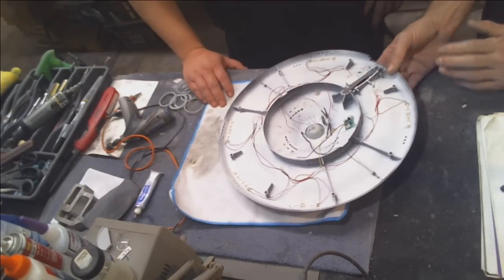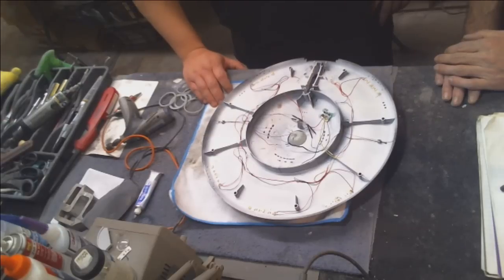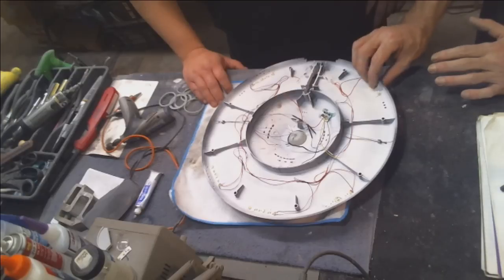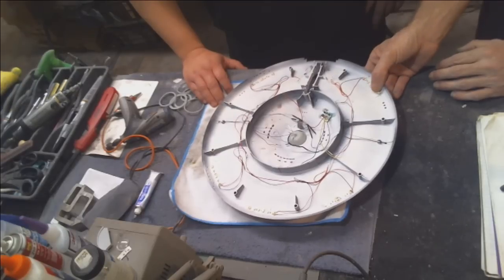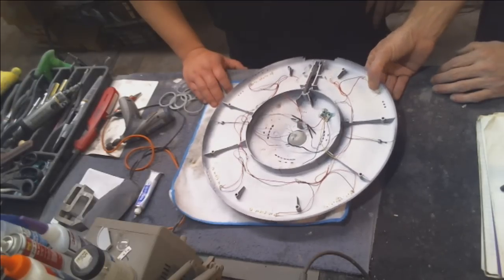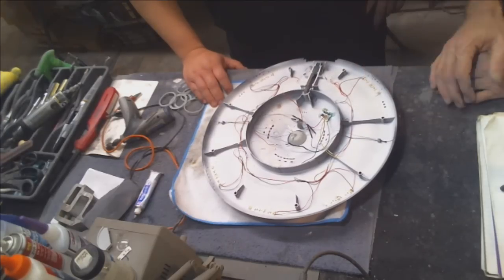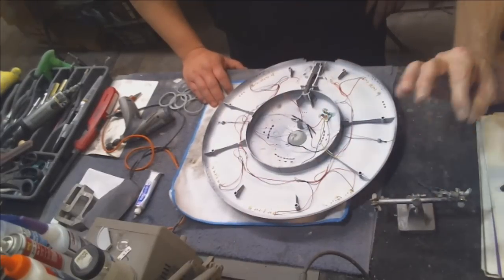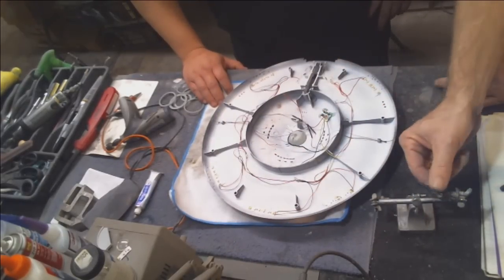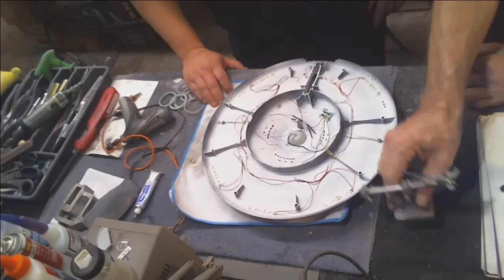So these are just little things you can do here and there. He's picking up little things where he's starting to work with the airbrush a little bit, and like I said, he's making really good progress at learning how to solder these little LED strips. That is hard enough in itself. There's a lot of people out there who comment on that quite often, that it's difficult. But I showed him the basic way I do it, and he's now able to bring out our little helping hands, lay down the strip, make nice small beads of solder, and then connect his wire on there without getting too shaky or putting too much solder on it. So he's really doing a great job of that.